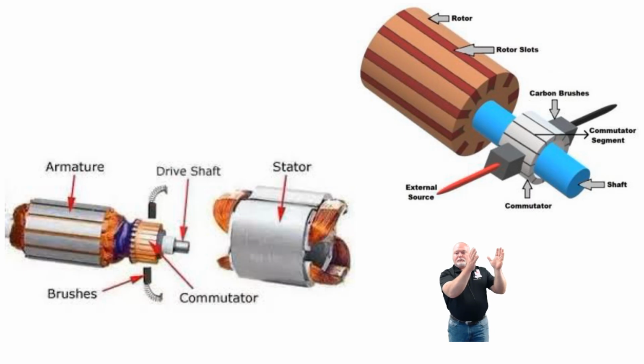So over time, those brushes do start to wear out. They're made out of a carbon material, and they start to wear down, much like the brake pads on your vehicle. The rotors on your wheels are turning, the brake pads are trying to slow them down, and it wears that pad off and builds up a sort of charcoal looking surface. So we're going to look at some real live versions of this in just a minute. I just wanted you to better understand what's happening inside that motor.